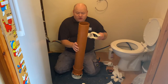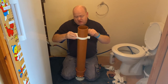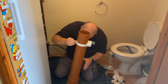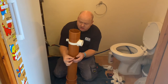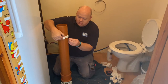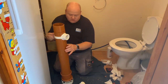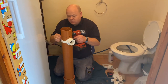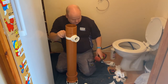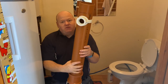What I'm going to do now is cut this with a hole saw and connect this strap-on boss onto there. I've cut the hole out, so I'm just going to put some solvent cement around here and also on the strap-on as well. This pipe is actually underground - the pipe is not really designed for this. We'll stick that on there and then we've got a nut and a bolt to put in there, and we'll tighten that up and wipe off any excess.